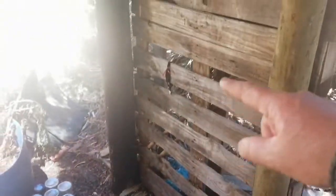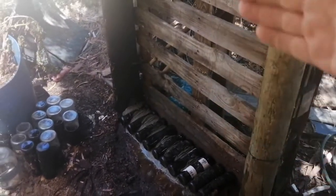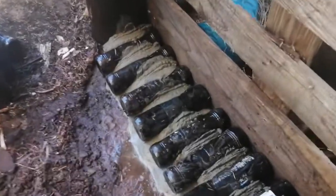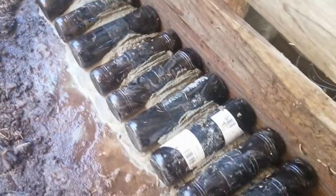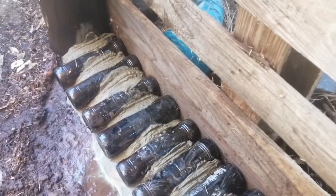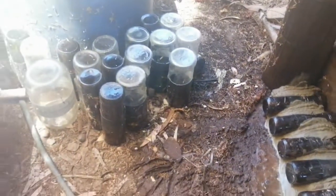These are bricks I made out of bottles. I'm going to build them against the pallets here, and at the end I'll remove the pallets - they're just serving to make sure everything on the outside is nice and level or plumb. Here you can see the first layer; I put the bottles in and they've been filled with a bit of cement. My buddy is busy making a new batch of cement, because that's one of the things in life that I don't do, and then all these guys are going to go in there.